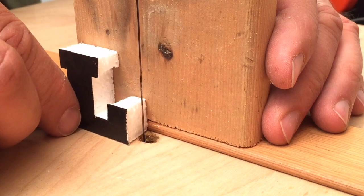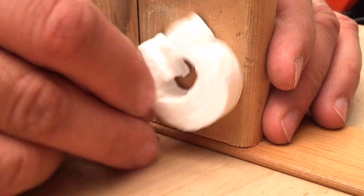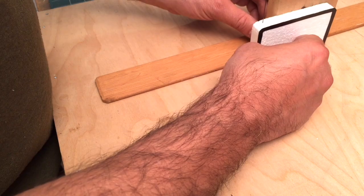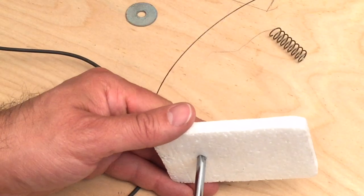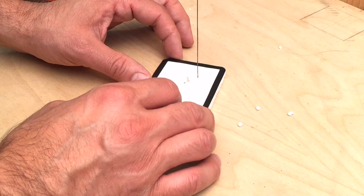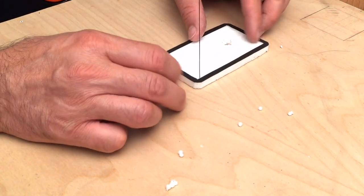Here I'm slicing down the letters — they're just a little bit too thick — and I'm using a board just as a fence. This black border I want raised at the same height as the letters, so I'm going to cut the pattern in half and disassemble my wire for the hot wire foam cutter. Here I am poking a hole through my foam and passing the hot wire through, and now I can cut out the interior and have this nice raised border.